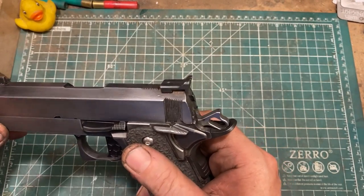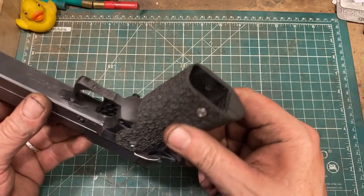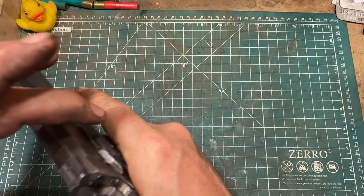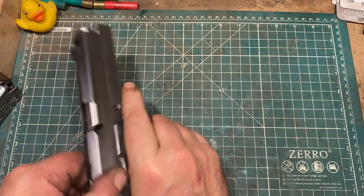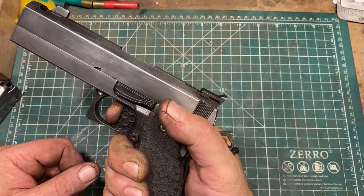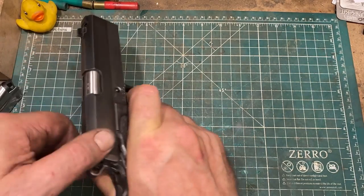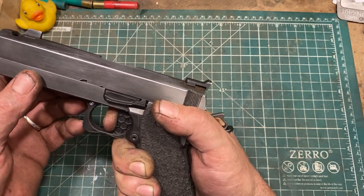The front sight is just a generic tall front sight that came from EGW as well. Those are the basic features. It does have an ambidextrous safety — one I've used on a different gun; I changed that one out for a bigger paddle because that's a competition gun. The trigger pull is what I think of as a very intentional trigger: there's a little bit of take-up, then you hit a hard wall before the trigger goes, but it goes with virtually no over-travel, and the reset is extremely short — around 12 thousandths of an inch as near as I can tell.